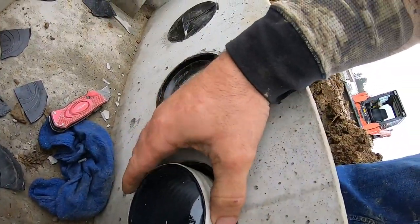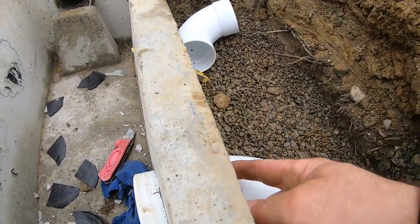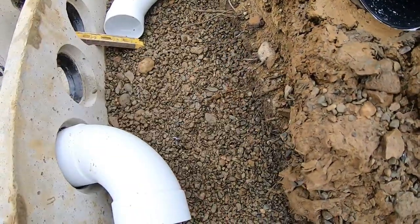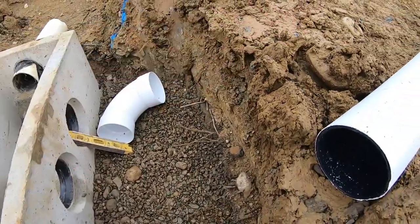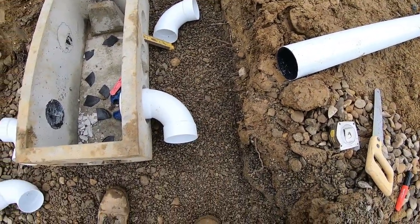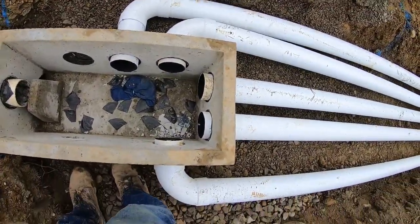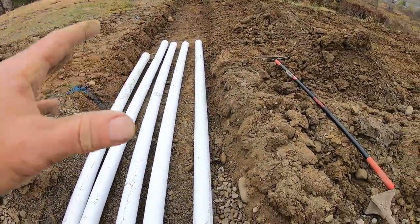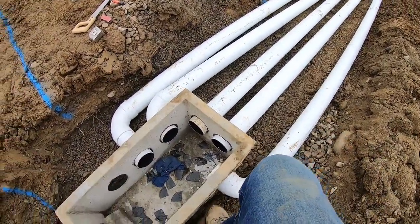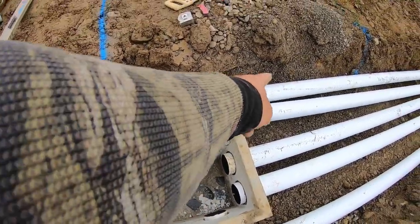You see how that pipe goes on there. Make sure your first one's super tight, so this 90's just about right there, because you got to come around with this next pipe, then that pipe goes straight out. But that's why you got to give yourself enough room on the overdigs, or the pipe don't fit. All right, so here's my trunk. There's my lines all in. Just wanted to make sure everything fit and got started. Cut all my pieces in here. There's pieces in each 90. 4-inch cut there, 8-inch cut to get around that.